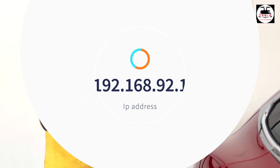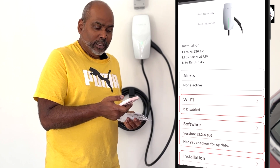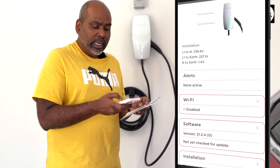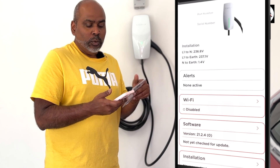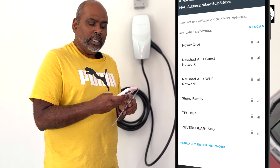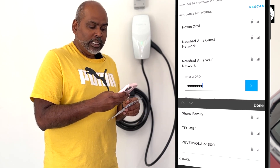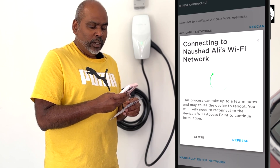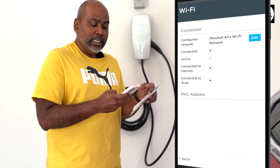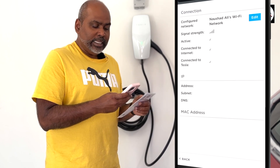Once you get into that IP address, this will lead you to a particular web page where you can see your part number, serial number, installation details — L1, L2, neutral, and earth — and you can see if there are any active alerts. First off it'll tell you Wi-Fi is disabled because now you want to connect to your home Wi-Fi. Click on the Wi-Fi symbol, it'll open all the available networks, select your network, enter the password, and it says the connection is active. Then you wait a few seconds — it finds the MAC address, subnet, DNS, and the whole works.